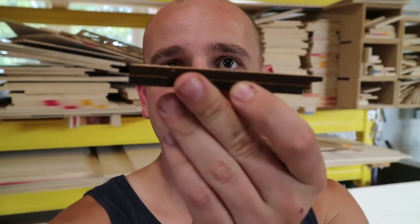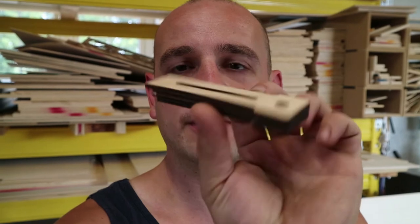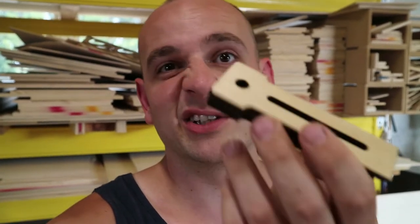Right then, so these are the cam clamps. What we've done here is we've laser cut this out of two pieces of 6mm, and then just stuck them together. We use a super glue by Hayfell, which is just CA glue, just Mitre Mate. Just cheap super glue, and it works perfectly. But yeah, we've cut it out of two pieces of 6mm. If you've got a CNC, you can CNC them out. You don't need a laser machine. You could cut them with a jigsaw or a scroll saw if you needed to, but use what you've got. We're a business. Time is money and all that, right?